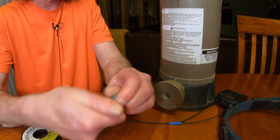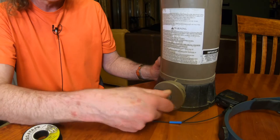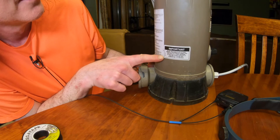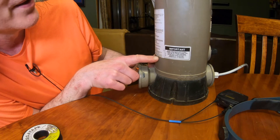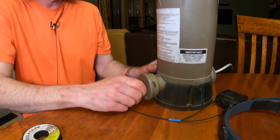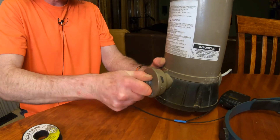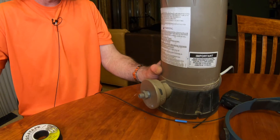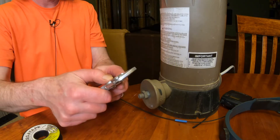What I like to do is push it on like this. The key is to not over-tighten it. It says it right on the fitting in big letters: 'Do not over-tighten pipe fittings. Proper fitting makeup is hand tight plus one to one-and-a-half turns maximum.' It also says to use the proper tape. So I'm going to hand-tighten it, attach it to the pool, and if it leaks, give it just a little more tighten.